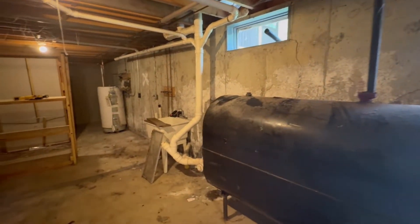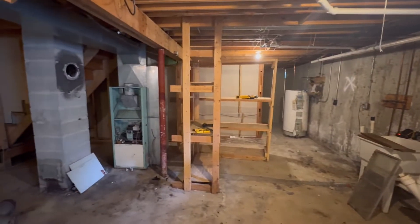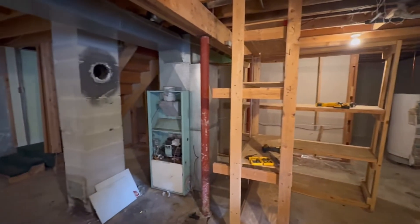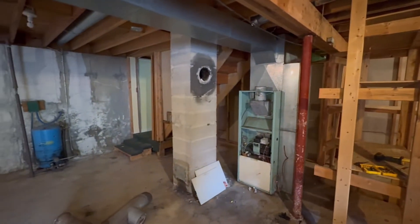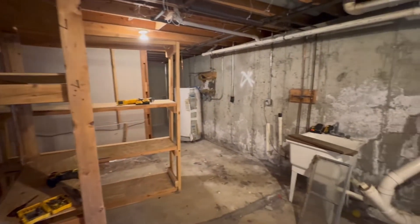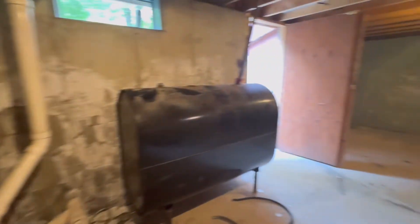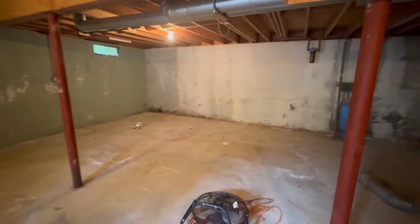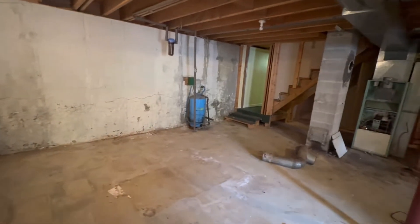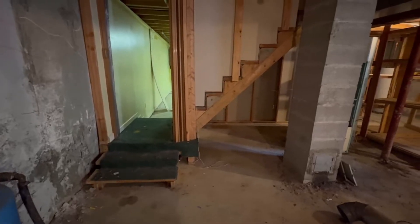Another thing you'll often see in these older houses are old appliances — water heaters, oil tanks, etc. We often tell people that because everything has to come out, if you have older stuff, don't replace it until the time of your foundation replacement. It's the best time to do it because everything has to come out anyway. This house was built in 1986, so it's got some older appliances they just ended up limping through until now. The rule of thumb is: anything that touches the concrete has to be removed.